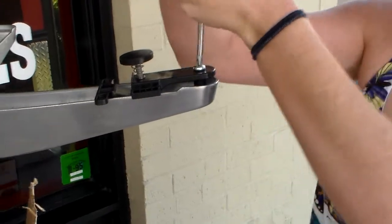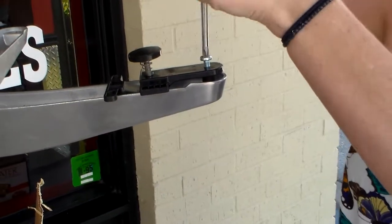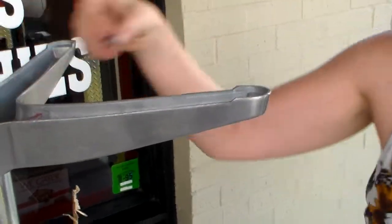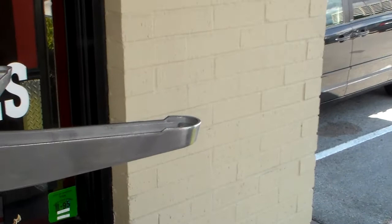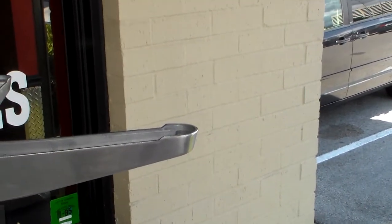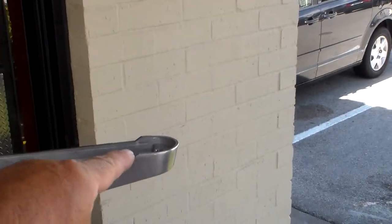Again, you want them shoulders to touch the side. You don't want them to have spring in there, because it will have spring if your table's not heavy. If you have a real heavy table, it could get that out. If you don't have a heavy table, well, then it's going to spring there, and it's never going to be stable. You always want to make sure that them shoulders sit on this base right here.